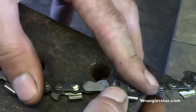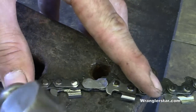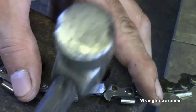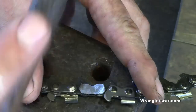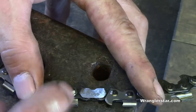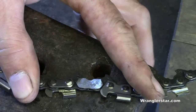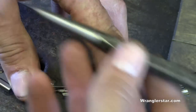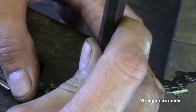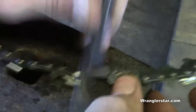So we need to drive out the old link. We're going to put our chain on some sort of an immovable surface — this is an anvil, but you can use the back of your vise, a chunk of railroad tie, or whatever you have that's really hard. Just take your small pin hammer and whack that a couple of times. What that'll do is expose the circles starting to come out where we need to drive it. We're going to take a center punch — just a round punch with a ground point on it — and put that right in the center over a hole.